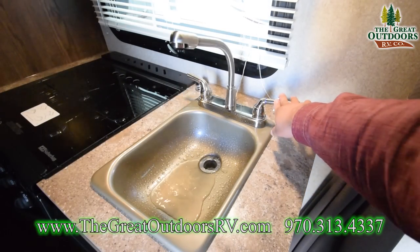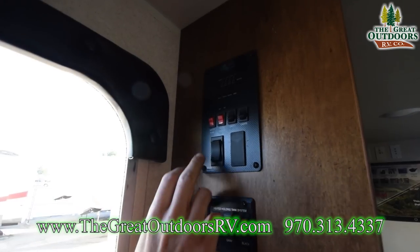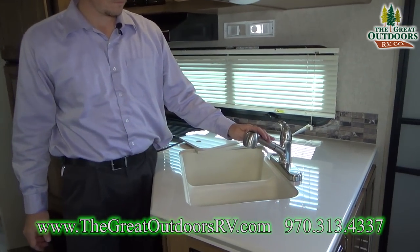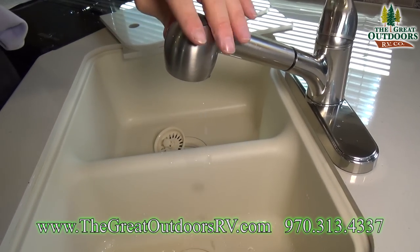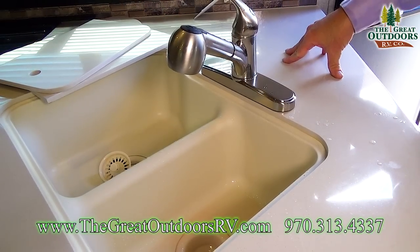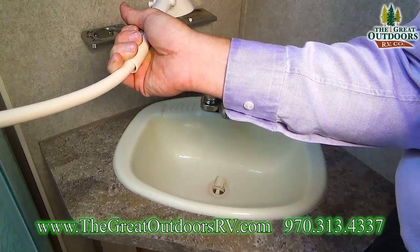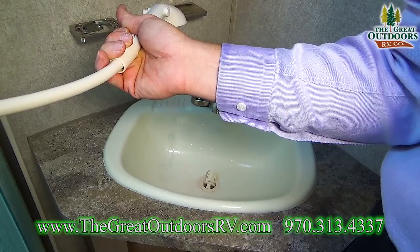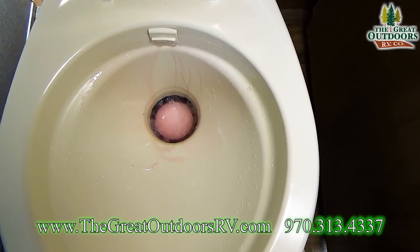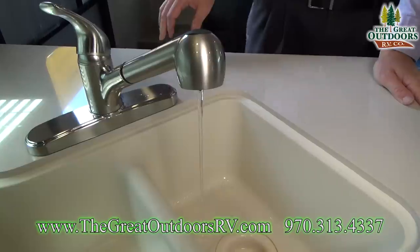To recap: close all your faucets including your shower and sink. Then turn on your water pump. After that, start sucking in the antifreeze through your water pump by opening up the valves closest to your water pump — so if that's your bathroom sink, start there. Turn on your hot water first or your cold water, just one at a time. It'll run clear for a little while or spurt air, and then it'll start to have some pink antifreeze. Then close that off and move on to the next thing. Do this for your shower, your toilet, your sink, your outside shower, and any other appliances that have water ran to them.